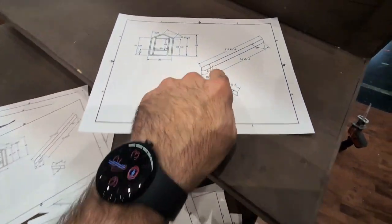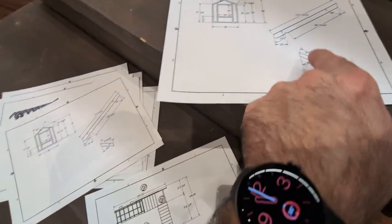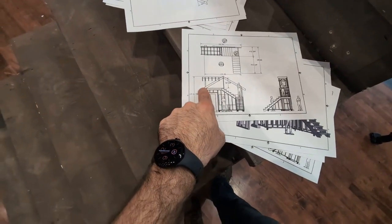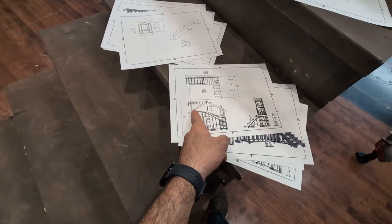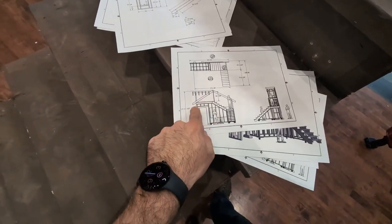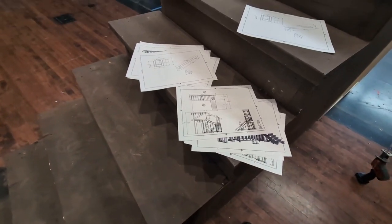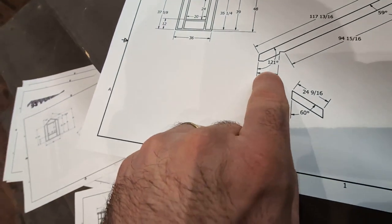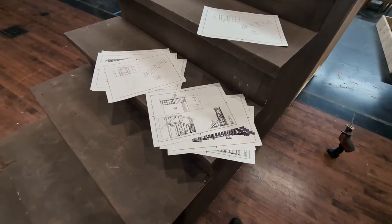But that's the thing. See, the bird's mouth location in the rafter is based on what we do here. Same with the dormer gable end, I don't know what dimension to make it out of either. And if I'm making it out of wider lumber, I'm hanging it out into space too, because we've committed to this lower wall length and this landing length and everything. Mostly this rafter could be made, and it's just a matter of whether the bird's mouth gets another 2, 3, or whatever inches deeper, from 16 inches back to whatever it ends up becoming there. So I suppose I can get 90% through the building of that stuff.